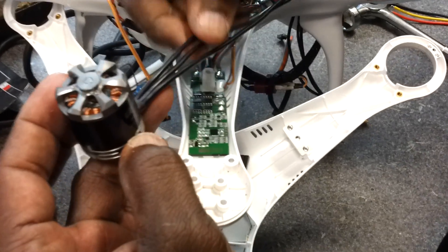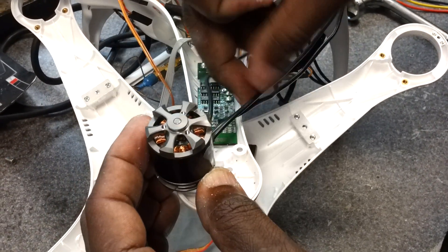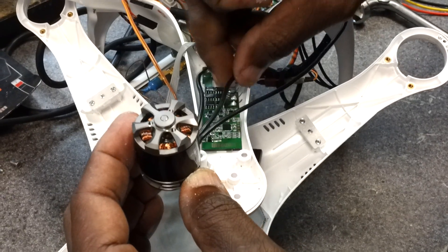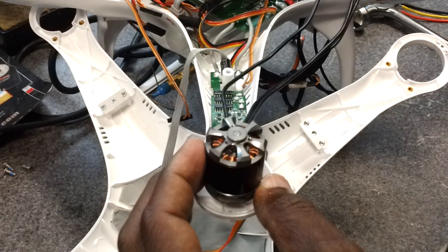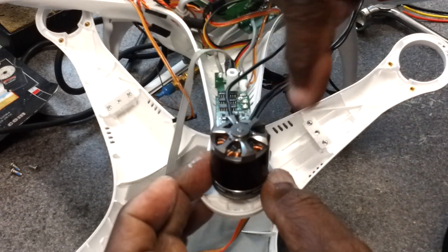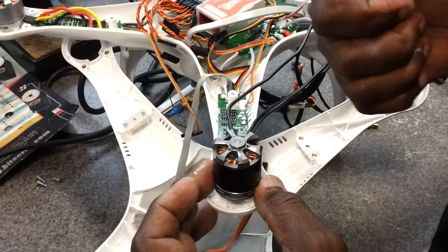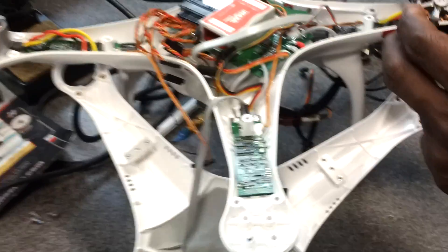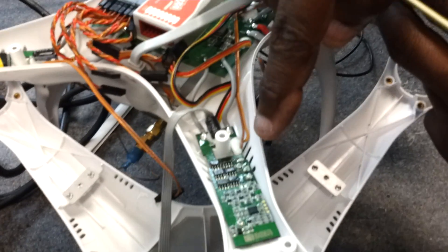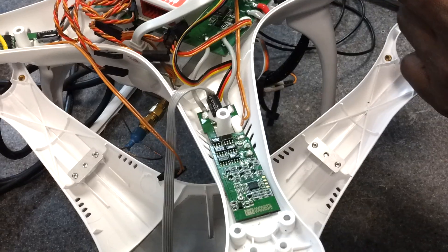What you're going to have to do is solder wire one to that one, wire two to the second, and wire three. After you do that, you're going to actually have to power it up and arm it. Check the motor direction — if it's spinning correct, then you won. Then go to the next motor and reverse any of the wires you did to the very first motor. That way you'll keep an opposite rotation of each motor.